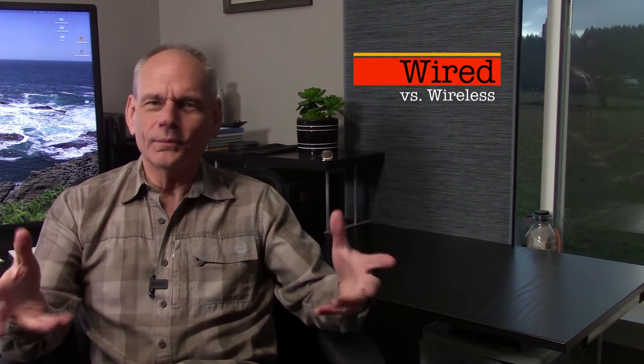So let's get right into it. You've got internet coming to your house, and then you have this detached outbuilding, and you want to extend the internet service to it. How do you do that? Does it go wired, does it go wireless? For us, I looked at going wired when we had a trench open while extending AC power from the breaker panel to the barn. But it turns out it's a no-no to run data lines right alongside power lines because AC power puts out interference that doesn't play nice with data lines.